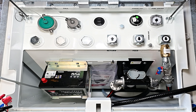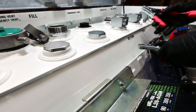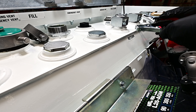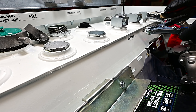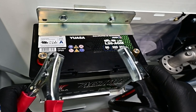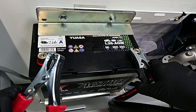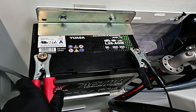For a 12 volt pump, proceed to connect the croc cables to the battery. For a 240 volt or 110 volt pump, just plug it into a main power source. It's very important on 12 volt and 24 volt pumps that you get the polarity right. That means just follow the colors on the croc clips to match the colors on the battery. Starting with the negative, which is always black — connect the black first, then go on and connect the red one.